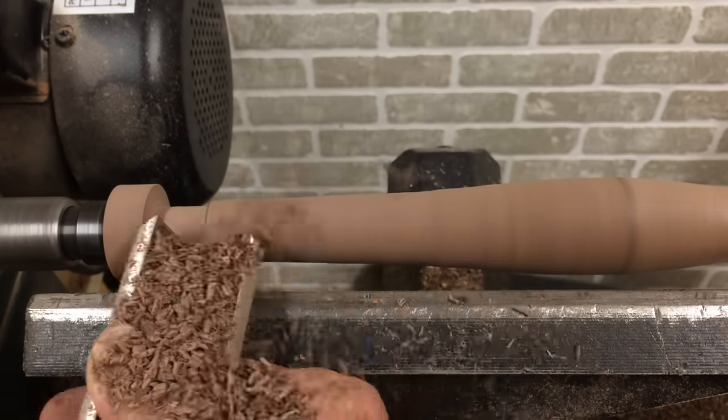I pulled off the arm here, and you can see some of the old glue and some of the finish that's been trapped under there. This is from furniture stripping, and the screw that was in here was firm, but unfortunately it's not grabbing this arm - you can see some threads were in some glue. What I need to do is put a longer screw in here when I reattach this to make sure I've got a really strong connection. I'll clean this up, glue it back together, and we're good to go. I'm ready to put the arm back on. What I've done is drilled out a slightly larger hole, and this is the new screw. I just have to drill a pilot hole into this part here, and then we'll be good to go on that one.